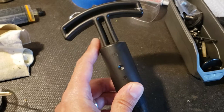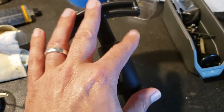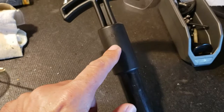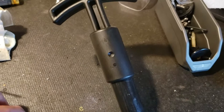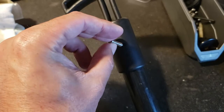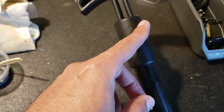All of it needs to get worked in there. What I'm going to do is drill again a small pin hole right here. I'm going to use a little bit thicker screw this time — I think this is the number eight — because I couldn't find the right size at the hardware store. As you can see, there's already kind of a pre-made divot for it to fit into, so I'm just going to drill that out a little bit deeper, run this pin in. Then same as before, I'm going to run my epoxy in lengthwise strips on either side and twist into place.